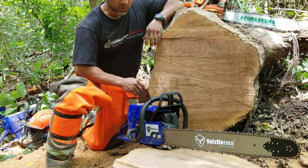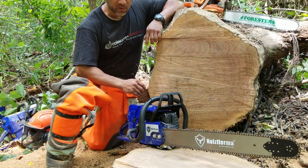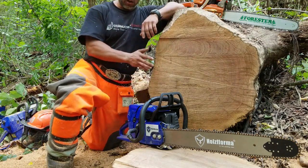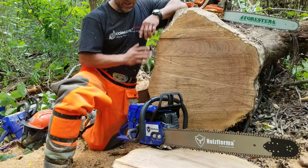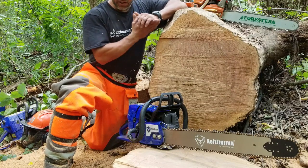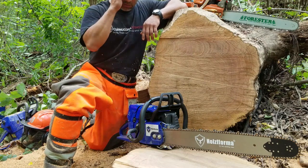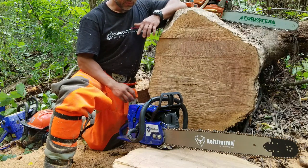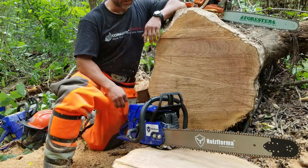But if you need to cut big wood all the time, maybe you don't want to do it with a saw like this. If you want to just cut logs up into rounds for firewood and they're this big, you definitely want to use the 660 in my mind. If you're just cutting trees down, as you saw when I did some plunge cuts with this saw, my first attempt failed, but my last one that I just did, with this piece of cookie, they can handle plunge cuts pretty easily. Plunge cuts are really hard on the nose of the bar for smaller saws, and this saw I think is somewhere around 5 horsepower. The 660 is close to 7, but these saws can do a lot of work between the 660 or the 888 or the 444 or any other numbers you want to pick.